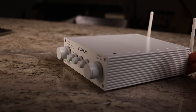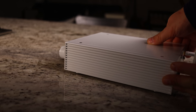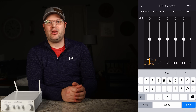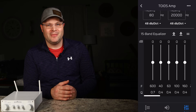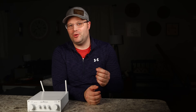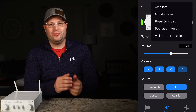What's not so pleasurable? There are some limitations. Because Acoustos is cutting down on the cost of entry — your time — it also means you do not get all the options you would normally get in a full DSP suite like Sigma Studios. For example, you currently have a 15-band EQ which you can set to whatever frequency you want, and you can adjust the Q to pick how much or how little of the surrounding frequencies get affected. But what it doesn't have — FIR filters. Well, at least not yet. I talked to the owner of the company and he said they will be implementing that very soon, and that update will be app-controlled, meaning all you have to do is press update on the app and it will do the rest for you.